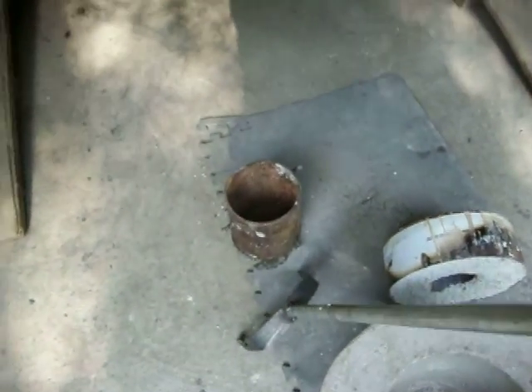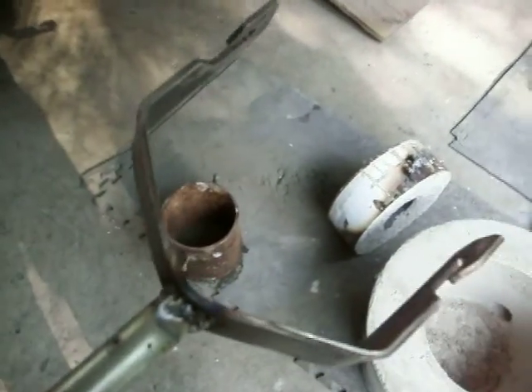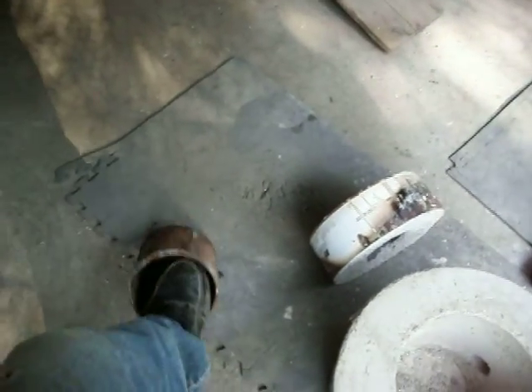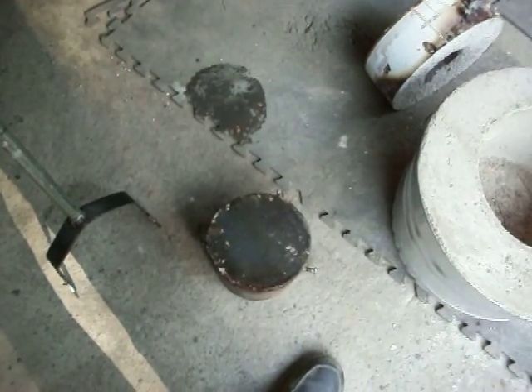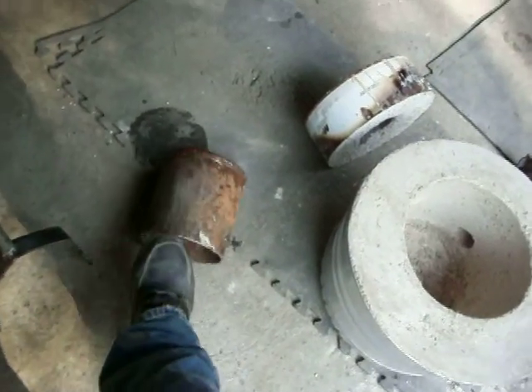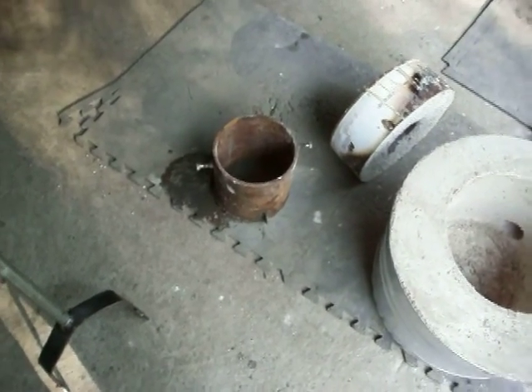The crucible is made from a piece of six inch well casing. The handle is made out of three quarter EMT. And then this strap - I made that and I cut the notches out on the milling machine. I drilled a couple holes as well so there wasn't so much to mill out. And I just bent it into a shape that will go around that crucible. The crucible is a piece of well pipe with a piece of plate that I welded on the bottom. I tested it with water and it holds water, so it will hold aluminum.